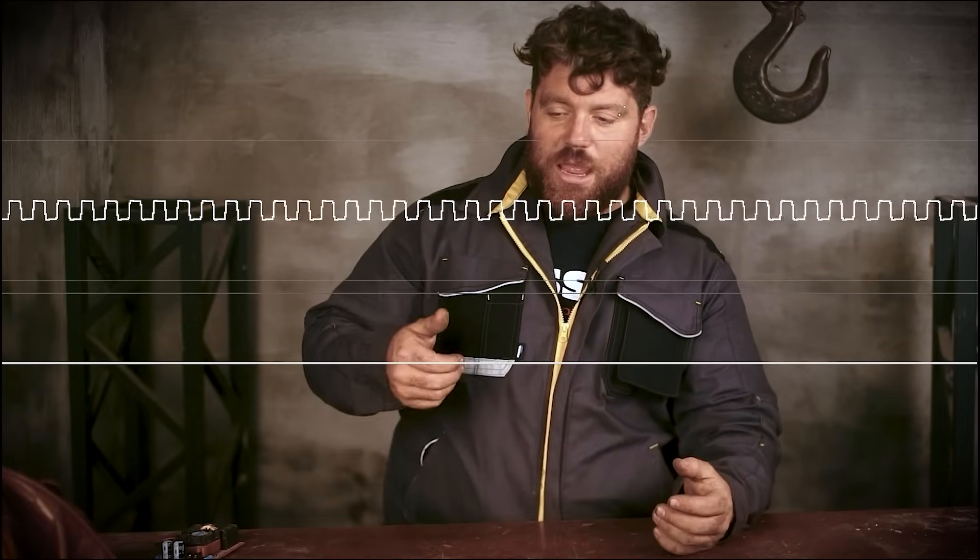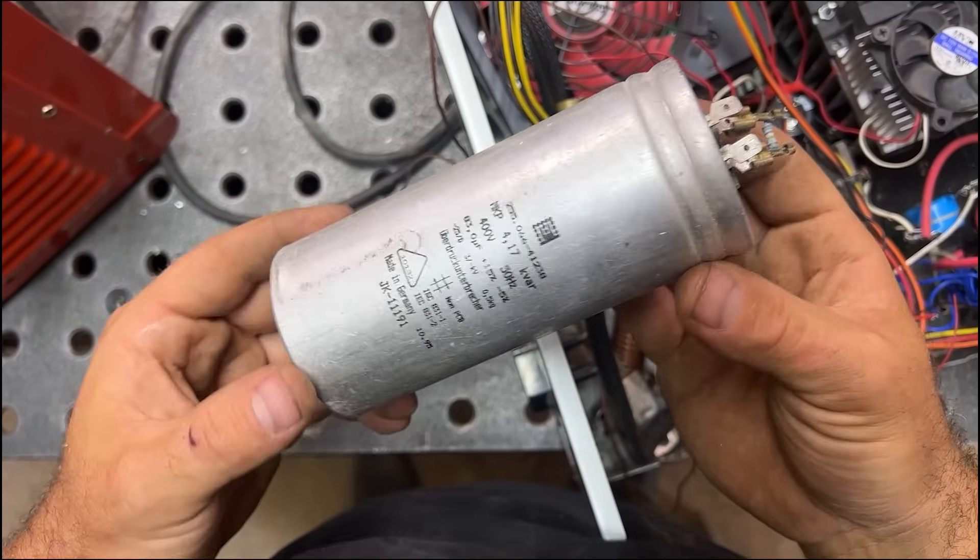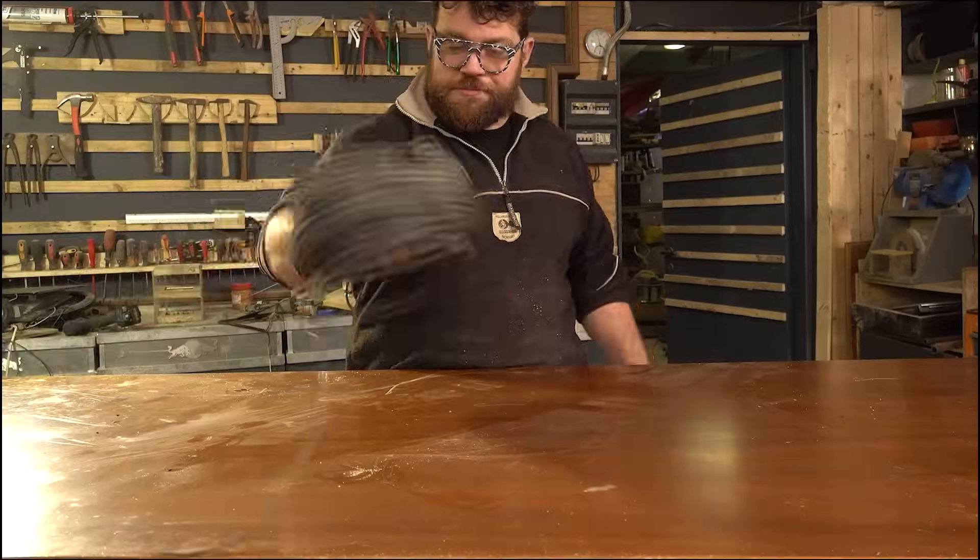Imagine it like water coming out of a garden hose — sometimes very high pressure, sometimes an air bubble, sometimes very low pressure. It is not stable: fast, slow, fast, slow. To stabilize water flow you install a large water reservoir, which keeps the flow steady. We can do the same with the bridge rectifier using a capacitor, but a large capacitor capable of handling high welding current is extremely expensive. There is a simple solution we can make at home: not a capacitor, but a coil, which works on the same principle of the water reservoir to keep everything stable.